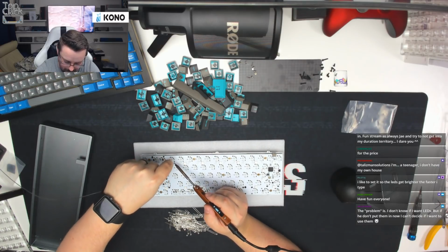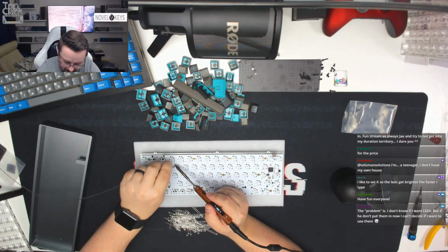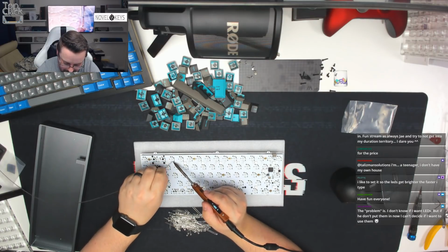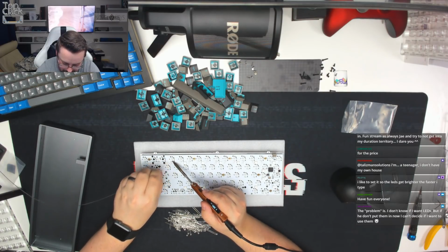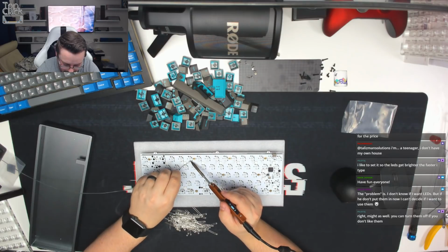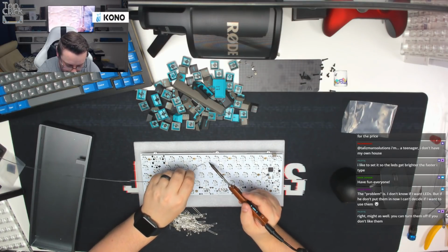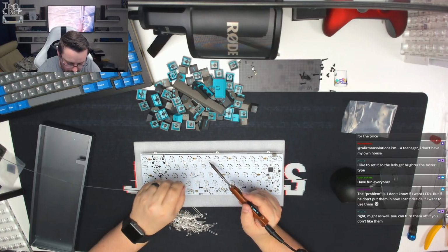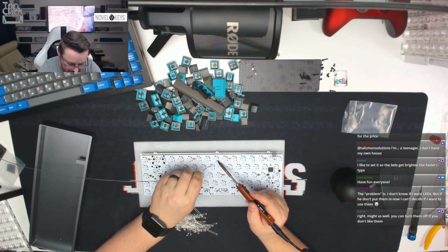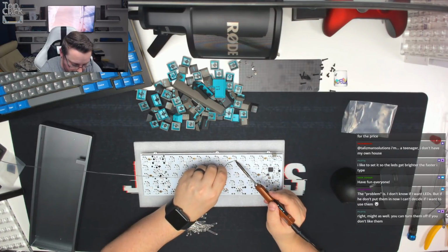This is why most people don't use LEDs in the hobby, because they are so fiddly to do. As I say, it doesn't really matter too much where the LED is based. We're just going to tag it and then we'll pull them all up afterwards and reheat them. I know that all of these aren't in position. We'll show you this afterwards actually. You'll see that these are all out of position, but we're going to just reflow them as we pull them into place.